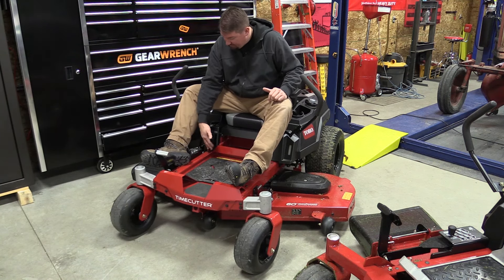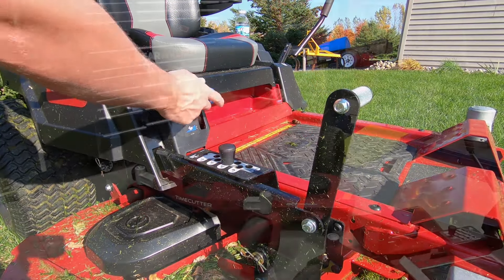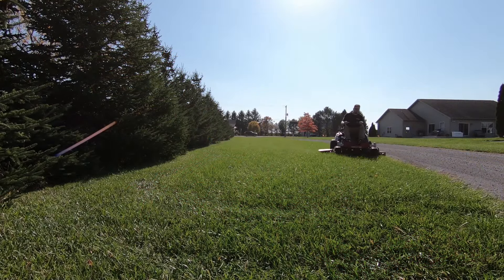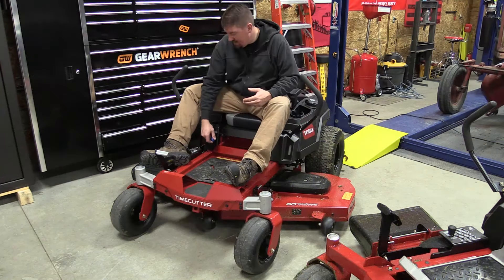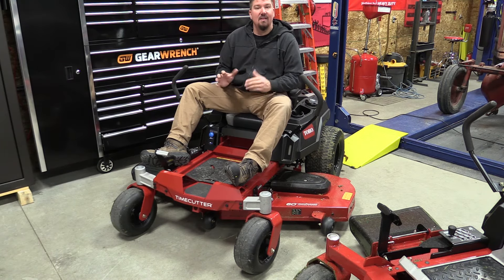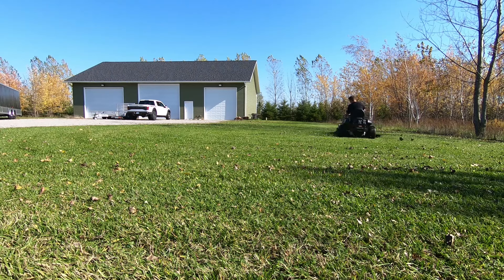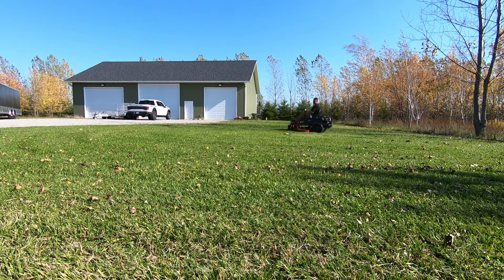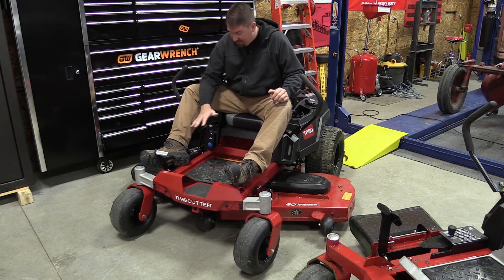Underneath here is a smart speed control system. You can slow it down to four miles an hour in its slowest mode, move it up to five and a half in tow mode — so you can tow a lawn roller or fertilizer spreader — or put it in fast mode. While both share the same transmissions, dropping into slow speed or trimming mode makes it very easy even for a new person to control. You can get around fire hydrants and trees without the machine being jerky at all. It gives you a lot of confidence, and the more I used it, the more I liked it.